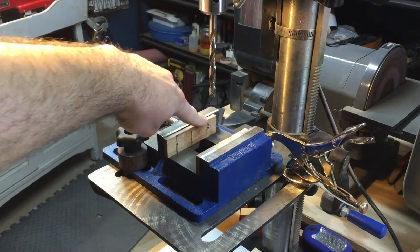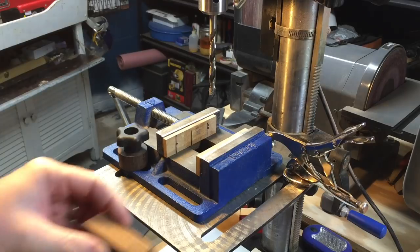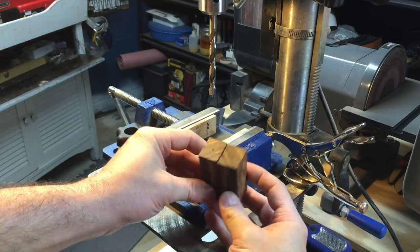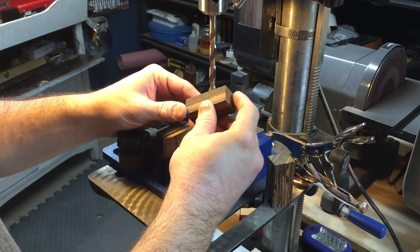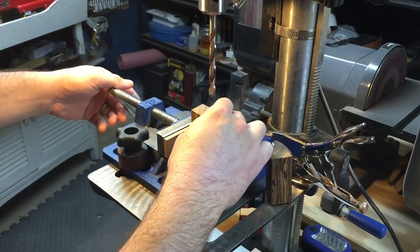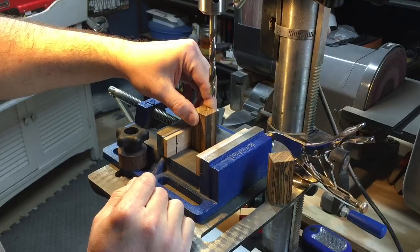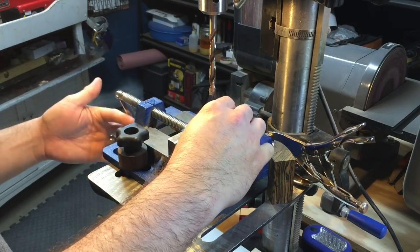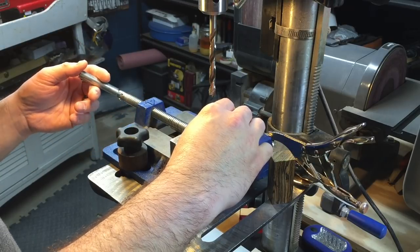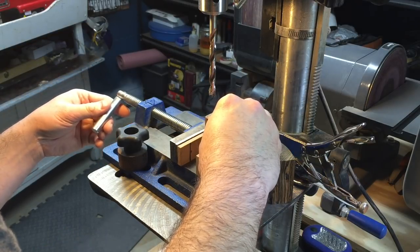There are many different ways to drill holes in your pen blanks — you can even do them on your lathe — but I use my drill press vise. This particular kit required an 8mm brad-point drill bit. I take my blank and align one edge of it to the lines on my clamp, and it'll end up square with my drill bit. It's not completely accurate, but in my opinion it's close enough. I like this method because I don't have to change out a lot of accessories on my drill press all the time.